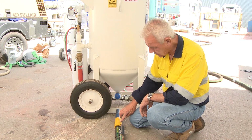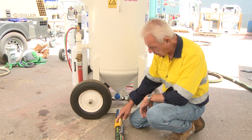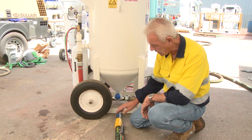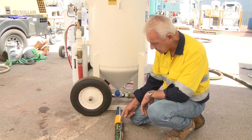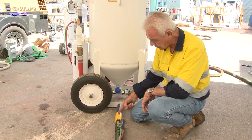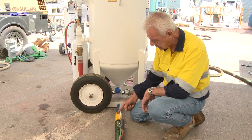So just remember that these screws have to be in, not penetrating the wall completely, silicon for the nozzle holder. The hose must always be cut straight and sent all the way up the nozzle holder into the bush or the stem in the back of this particular fitting.